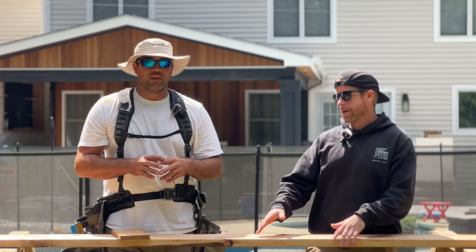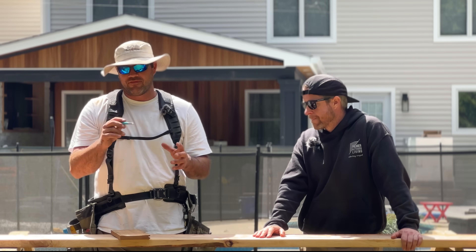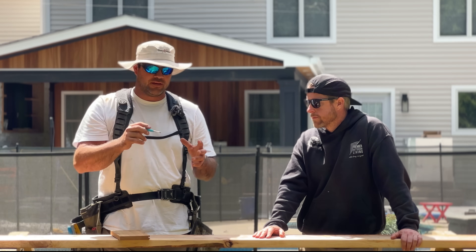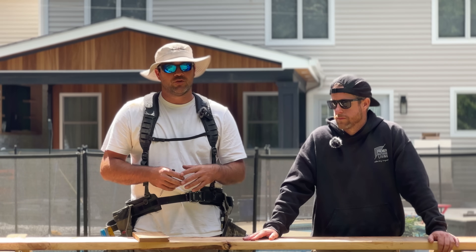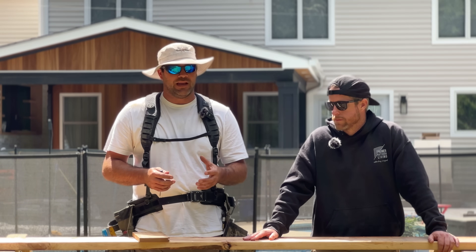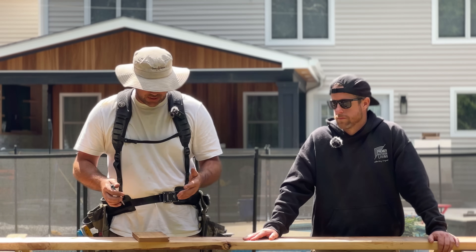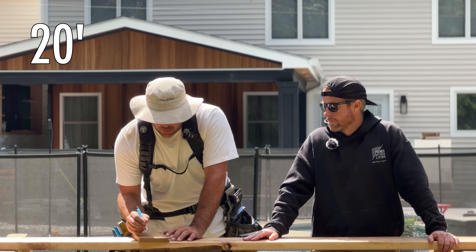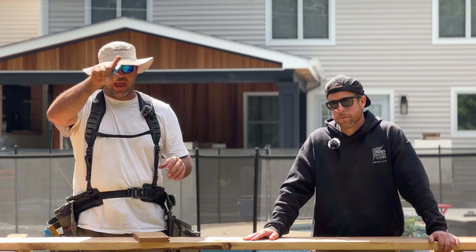All right, I'll do my best here. We're dealing with a basic gable roof — an A-frame — and we're trying to find that diagonal measurement of the roof rafter. There are two pieces of information that are already going to be set: the overall width of the building and the pitch. The overall width is 20 feet, and we're dealing with a 3-pitch, which is the angle of that triangle.